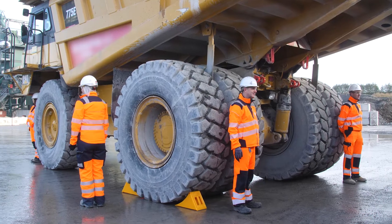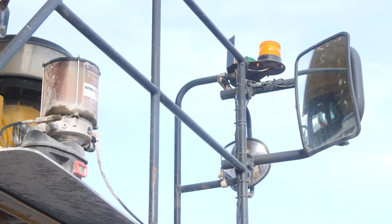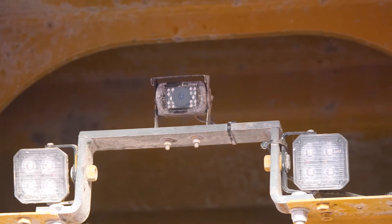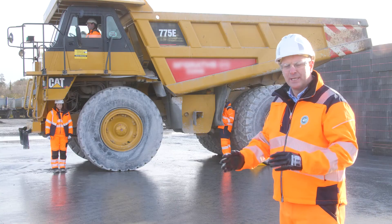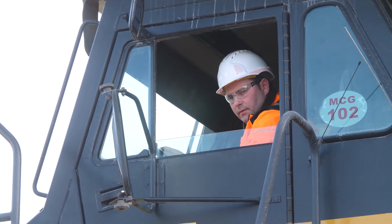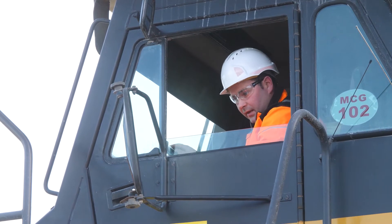You can see some people in front of the front wheel and front and rear of the rear wheels. Even though this machine has some very good convex mirrors in place and a reverse camera to the rear, this machine still will have some blind spots. So it's really important for the operator to understand the importance of the blind spot survey prior to moving the vehicle. Now we're going to ask the driver to see who he can see by using the mirrors and camera in the machine.